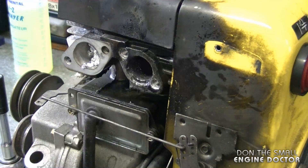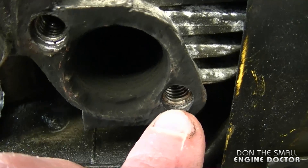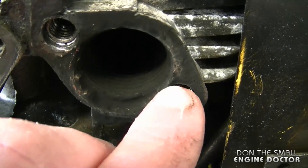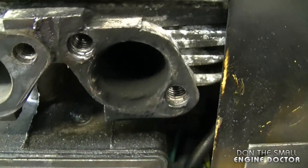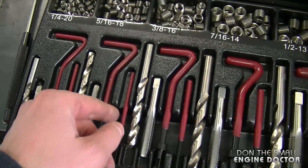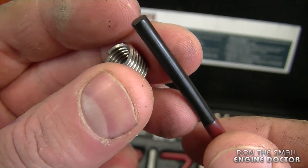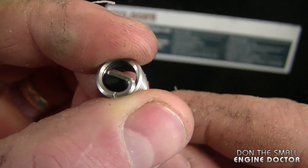Now don't forget to remove the protective foil, and you can see the coils in there. I probably didn't have to screw them in as deep — you can actually leave them one turn in after you're on the edge. But because it's so damaged I put it in further. Now that the inserts are in there, you want to grab this little tool from the kit. This little tool is like a little punch, and it's used to pop the little tang behind the coil.